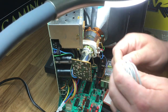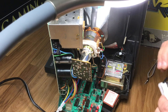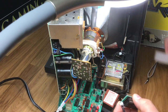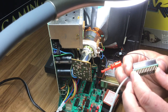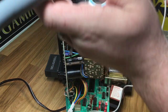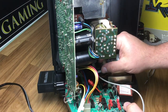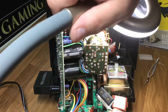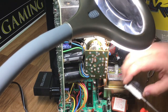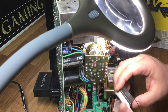Take the wire off the daughter board, take the foam off it that protects the legs, and stick it right here. The legs can be a little delicate and they're long enough so you can install it here. This part coming up — this is where you want to pay attention when you put your daughter board in. You want to make sure you really get the legs just right, and you want to make sure that it's well lit also. You're going to put it in with the cable toward the back right here.